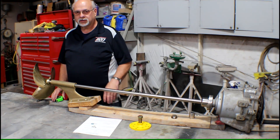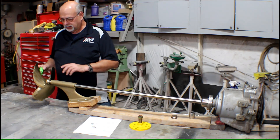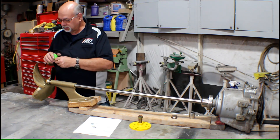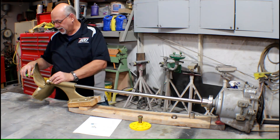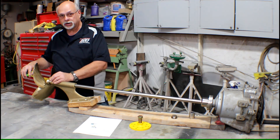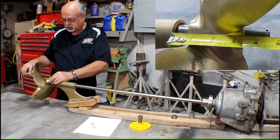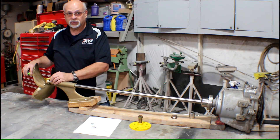A key number with our three quarter inch gap: the distance from the strut to the end of the shaft is four and three quarter inches for a typical ski boat prop, either a one inch shaft or inch and an eighth. I'll show you a close-up of this dimension here in just a second. That number is going to come into play here in just a few minutes.